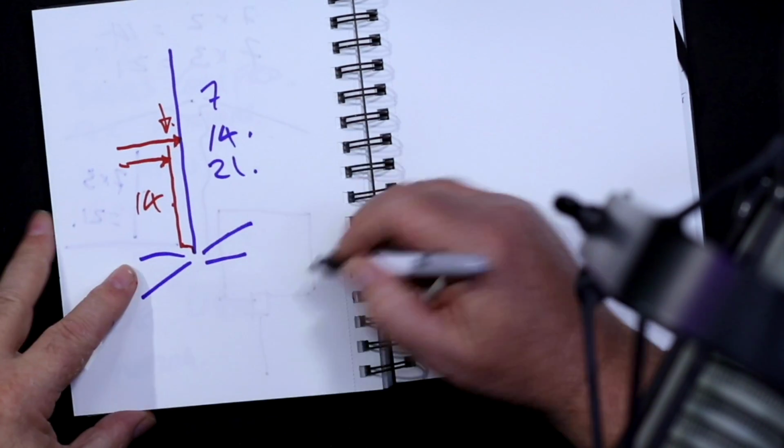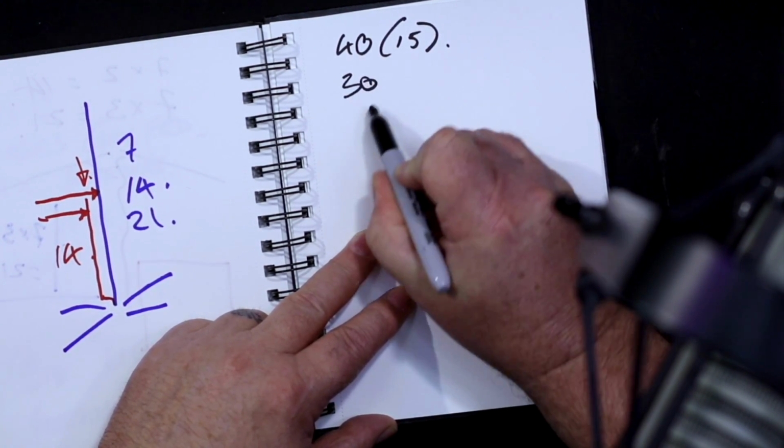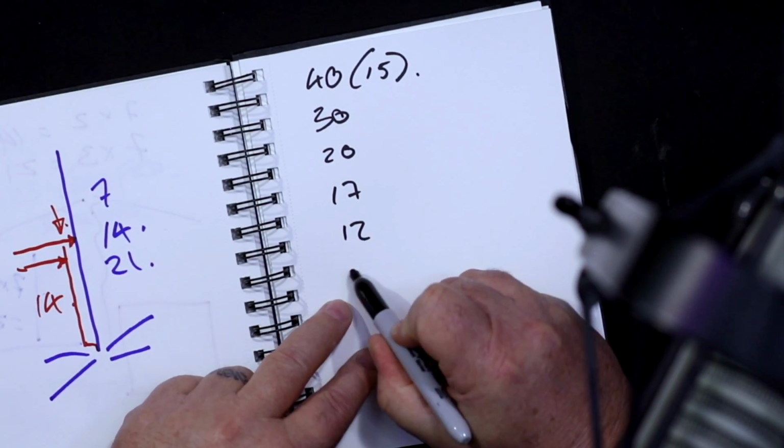It's just the same in the radio spectrum. If you want to naturally resonate a wire with RF, it needs to be a particular length. So if we cut all these different elements to a particular length, they will sing at the right frequency. Like a tuning fork, if you give it the wrong frequency, it won't resonate, will it? But if you hit it at just the right frequency, it'll tune. So that's what a fan dipole basically is, and this is what a DX Commander is. So basically, we've now got a system that allows us to take 6 elements, which gives us 40 meters, which also gives us 15. We can have 30, 20, 17, 12, and 10.